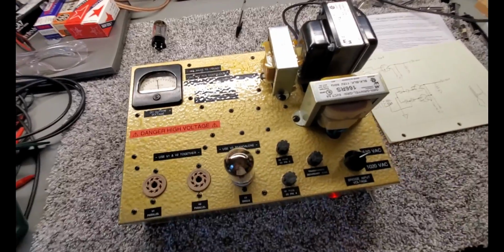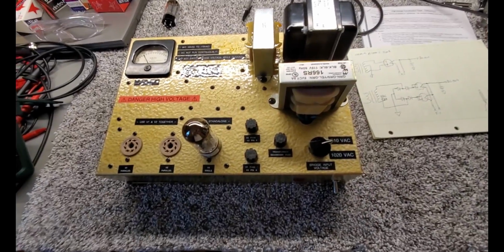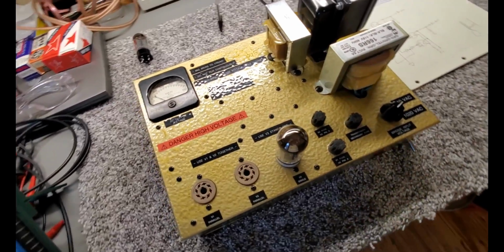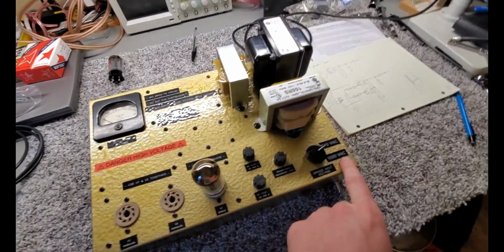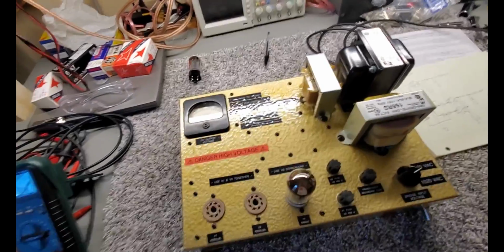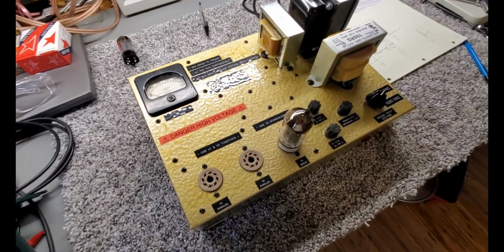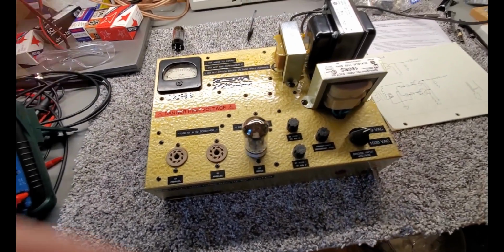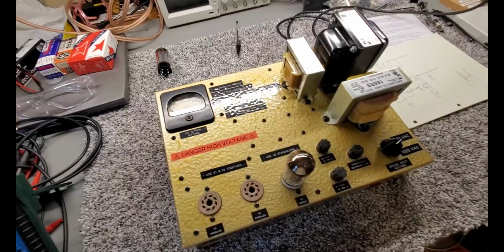So that would be a candidate to potentially move on to the 1020 volts. I'm not going to do that actually, because this is from the batch that I've had issues with. So I know at 1020 volts it's going to arc and take out all those fuses and be a mess. I was hoping that maybe this one would arc at that lower voltage like some of the other ones, but I guess it didn't. But anyway, that's what you get for trying stuff live.